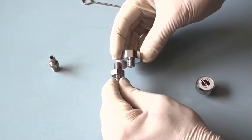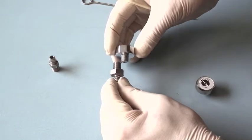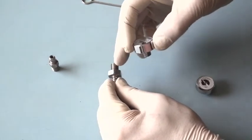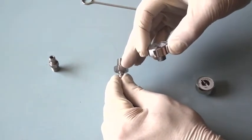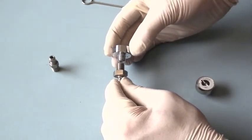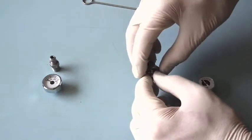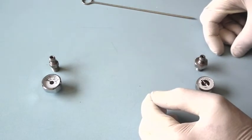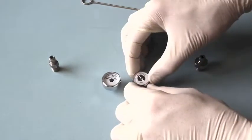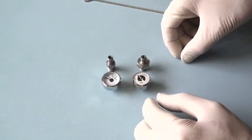The thing is, most threads in air gunning are known as 1/8 BSP or 1/8 NPT, so everything is interchangeable. It would be quite easy to take your pressure gauge from the front and your inlet fill nipple from the rear and, with a little bit of jiggery-pokery and possibly a small alteration, switch them over so that the gauge is at the back reading regulator pressure, and the inlet is at the front.